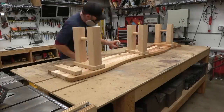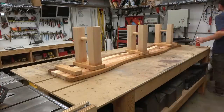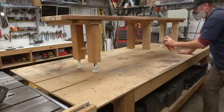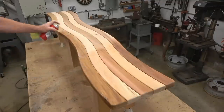I used a water-based spar urethane in a rattle can. It seemed to work pretty well. This is a satin finish, and I did about 3 coats of satin, and then I followed up with a semi-gloss, and I sanded right before the last coat.